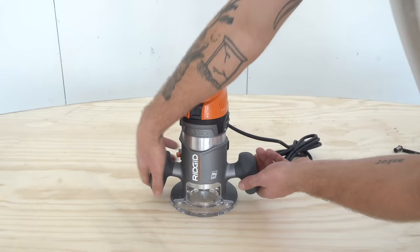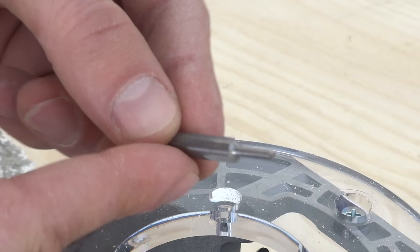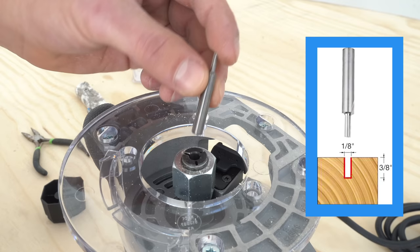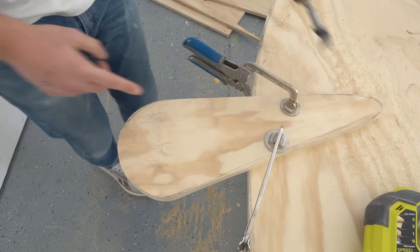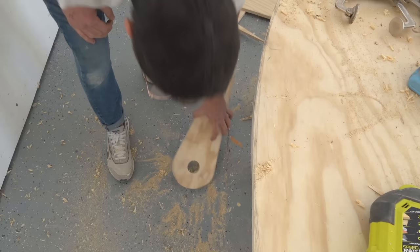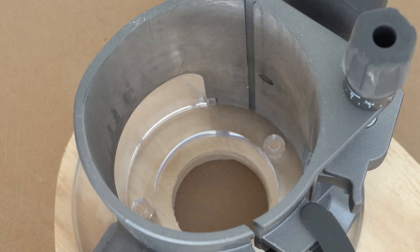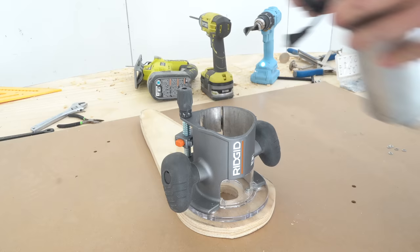Having a perfect circle cut out for my turntable in the middle is critical for the success of this project. So I'm loading up an eighth-inch straight cutting bit into my router and attaching that to a piece of plywood to create a circle cutting jig, just like the types you would buy. If you've ever made a compass out of a scrap piece of wood, this operates on the exact same principles. We're going to mount the router on one end of the jig, and on the other side everything will pivot on a three-eighth inch dowel.